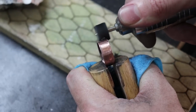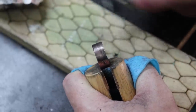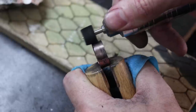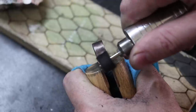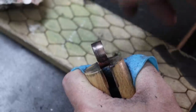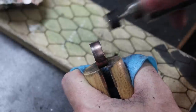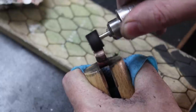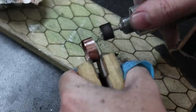This is what it looks like if you overload your polishing wheel with too much compound. To fix this, I use a piece of wood and just run the polishing wheel on the wood to remove some of the compound, then test it on the piece again. If it's still too much, rub it on the wood again — it usually fixes the problem pretty quickly. You can also just switch out the polishing pad if it's just too much on there and it's not clearing up.